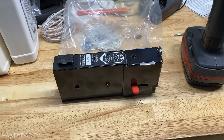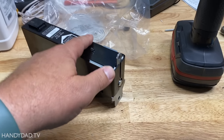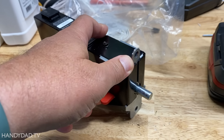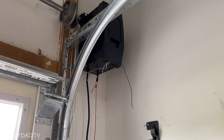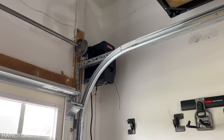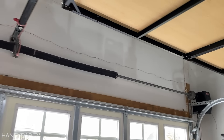You may have noticed that I didn't bother installing the electronic deadbolt. The opener locks the torsion shaft, but without the deadbolt, the door can technically be lifted by someone trying to break in. But it would be dead weight without the springs to help lift it, and my door is really heavy, so I don't see it as a big risk.